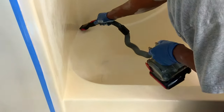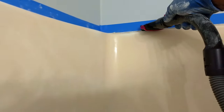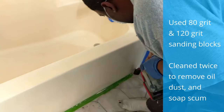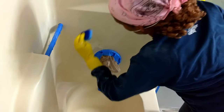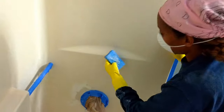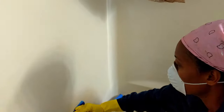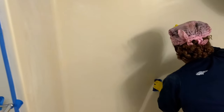Because we were doing a total bathroom renovation at the same time, we used the cordless vacuum to clean the initial drywall and fiberglass dust particles — it was almost like detailing a car. You can find links for this DIY in the description below. Then we had to clean the tub two more times with a heavy duty TSP cleaner to thoroughly remove any oils and remaining residue. Cleaning the entire tub and shower surround gave us a sense of its design features and how much area we would need to prime.